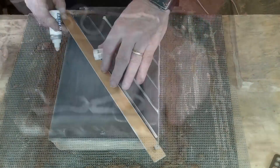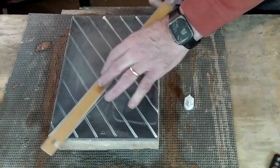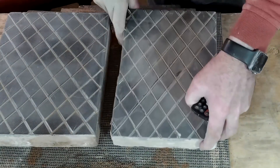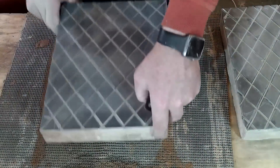I'm going to use the angle grinder to freehand cut a cross-hatch on both of these honing plates. The cross-hatch will capture excess abrasive material as a fine paste residue and redistribute the abrasive when in use.